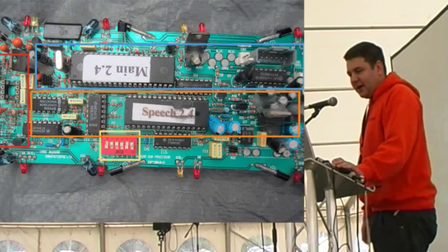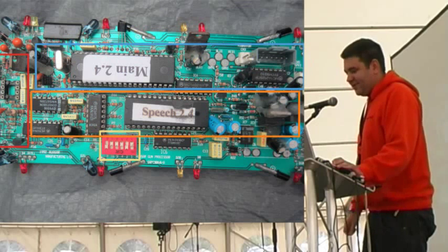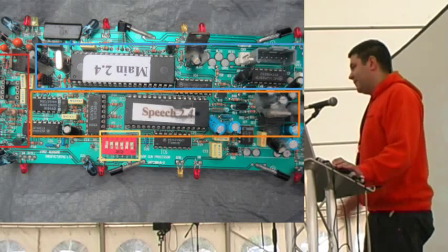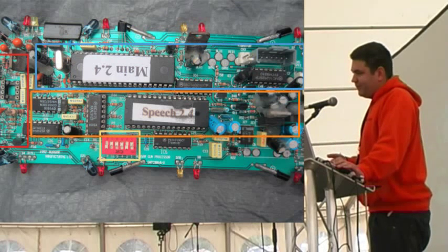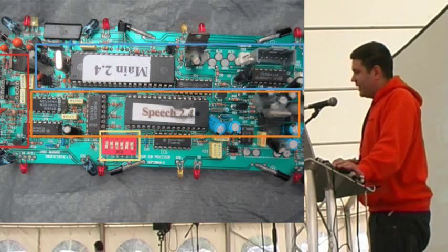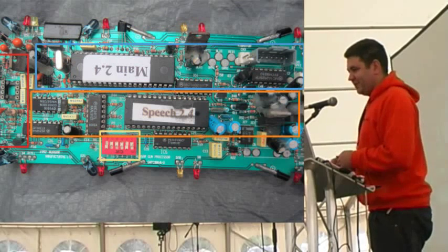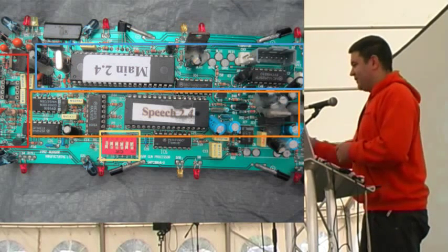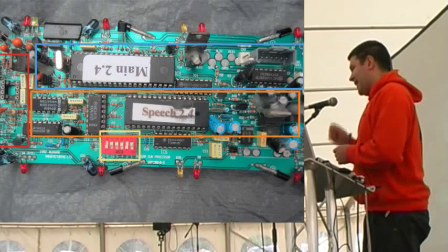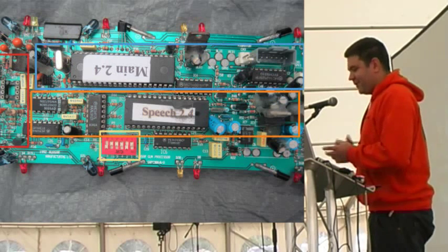There's the infrared section. Unfortunately the photo I took was missing a chip off the front - that's actually the demodulator. It converts the analog infrared signal coming in into a logic one/zero, which gets fed into the CPU. The way the chip generates and communicates was done in hardware - they used the serial port to do the infrared communication. Unlike most infrared protocols which use various encoding mechanisms, this system purely uses: if it's a logic one, it turns the infrared on; if it's a logic zero, it turns it off again. That's literally it - just straight RS-232. What that means is you can connect a little infrared receiver straight to a serial port and receive your data into it. It's a very simple protocol and it's effective.